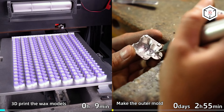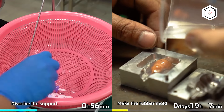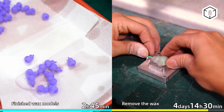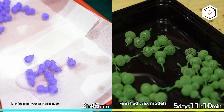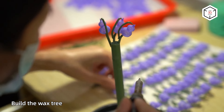The traditional method of jewelry manufacturing implies lost wax casting. Casting pattern creation is an expensive and time-consuming part of the process, and this is where 3D printing can be of great help, becoming a bridge to conventional manufacturing. With digital design opportunities and 3D printers capable of reproducing digital models with extreme precision and accuracy, it's now possible to create wax casting patterns of any complexity.